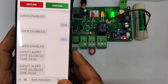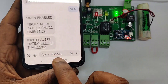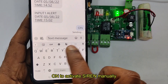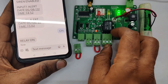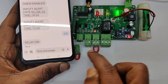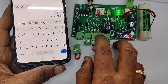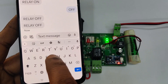If you open the sensor at RB0, you will not get further calls. That is, when the intruder closes the door back again, you will not get further SMS alerts. You can manually switch on the siren by sending SMS 'ON' — the relay will be on and the siren will stay on permanently until you send 'OFF' to switch off the relay and siren. You can also deactivate the system by sending SMS 'DSS' to deactivate the system.